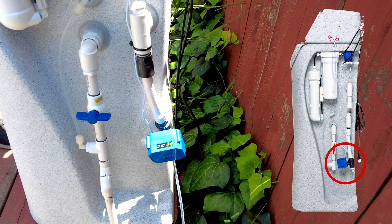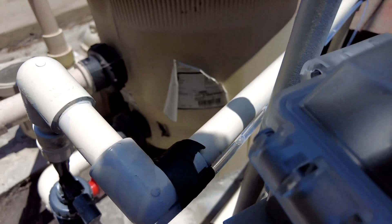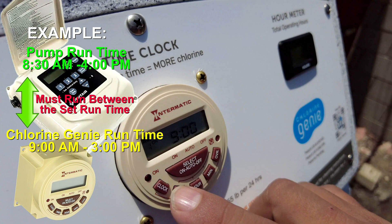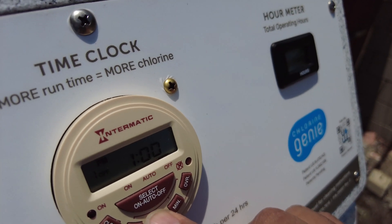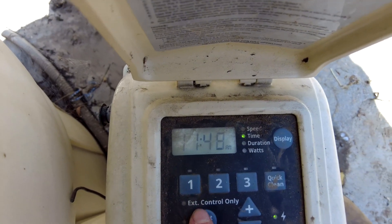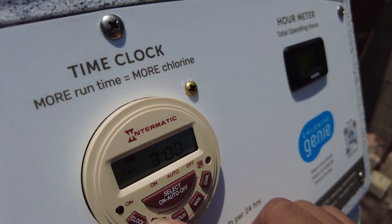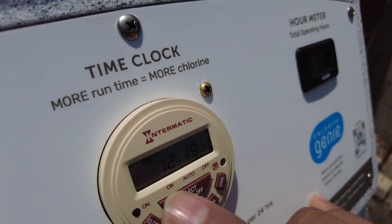There's one more electronic ball valve on the bottom where the chlorinated water is returned to the pool. It looks complicated but the actual water flow is pretty simple once you watch the device working. Another important aspect is that the timer on top of the Chlorine Genie must match the pool timer. This one is set to run from 9 a.m. to 3 p.m., while the pool is set to run from 8:30 a.m. to 4 p.m. It's really important the timers align so the Chlorine Genie comes on when the pool pump comes on, ensuring it's producing chlorine.